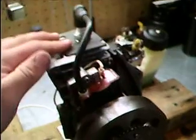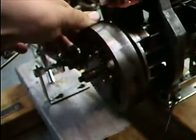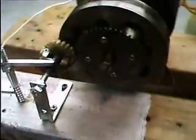When it did run, I could tell you that it didn't run exactly like a hit and miss engine would, or even a Maytag would. There were a few problems I encountered with this type of engine. It's low power. It doesn't have a lot of torque or horsepower, but it has high compression. That means it would need a large flywheel to compensate for that high compression and keep it spinning. But with a large flywheel, you also need the power to spin it, which this doesn't have. So instead of the traditional make, say, 20 RPMs, then fire once, it doesn't do that. In this case, it makes about 20 RPMs, fires 10-15 times to get back up to speed, then coasts down for 20 RPMs or so, likely more, and then takes 10-15 to get going again. So this probably wasn't the best engine to do it on.